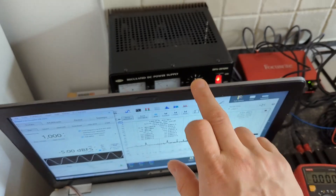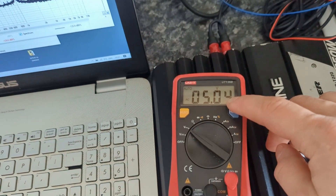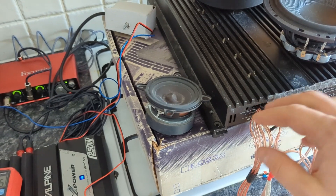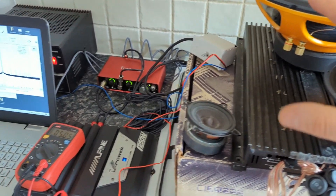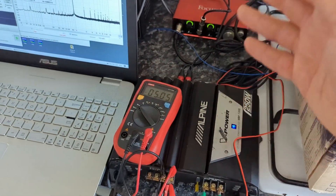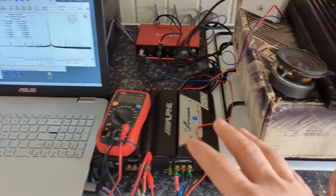I have a power supply, my focus probe, and everything set up. I'm going to play a minus 5 dBFS signal at 1000 Hz and I'll be measuring at about 5 volts. I won't be checking wattage because wattage can only be calculated if you have a resistive load of a certain value. My resistive load is about 4 ohms, 4.2 ohms, and I will be taking exactly the same measurements across all loads without changing anything.